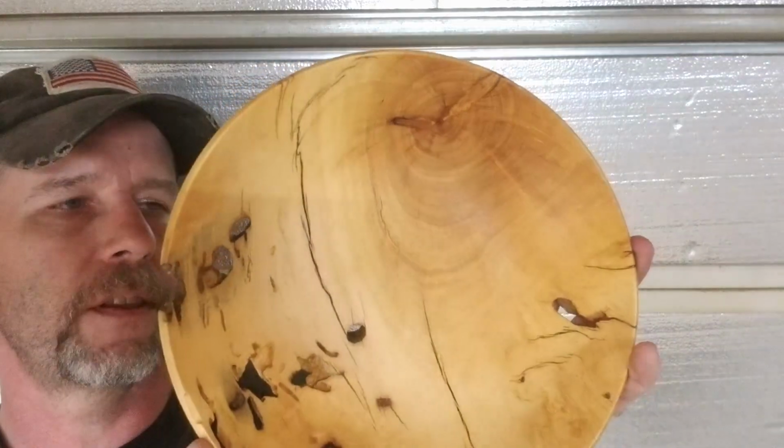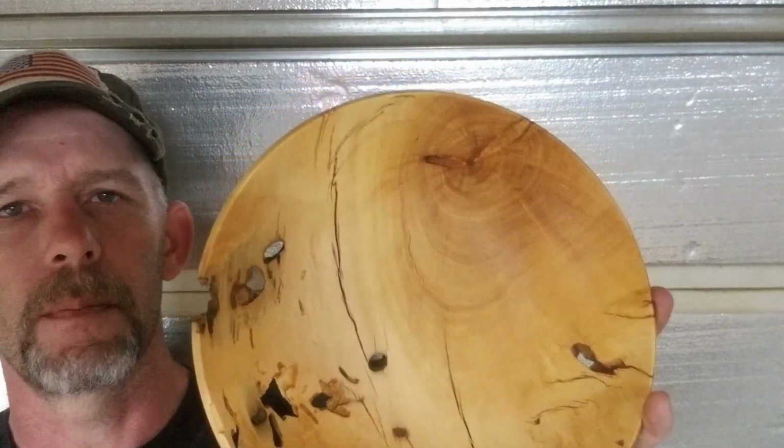Because the only thing that might have made it a little better was if the wood wasn't so filled with pine resin that I couldn't sand it. I only sanded up to 180 and about 20, 30 seconds with the piece of sandpaper, and it was completely clogged. So I wasn't even going to bother trying to go up to the finer grits. They would have clogged even faster.